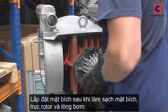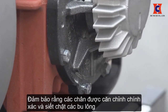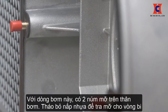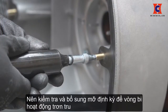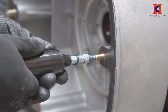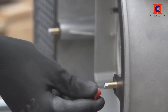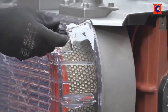Reattach the end shield after thoroughly cleaning the face of the rotor and shield and rotor shaft. Make sure the pins are aligned correctly and tighten the cover bolts. Install the exhaust cover, then reconnect the grease line. Inside the filter chamber there are two grease nipples — remove the plastic caps from the nipples and repack each bearing with approximately 10 grams (20 strokes of the grease gun) with Amblygon TA 15/2 grease. Clean grease nipples of any remaining grease, replace the caps, and install the filter cartridge. Replace the gasket if necessary and put the filter cover back on; the knobs are to be hand tight.